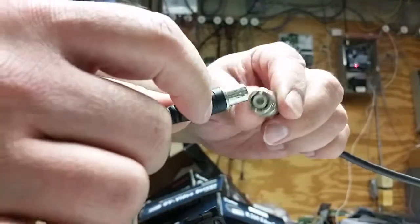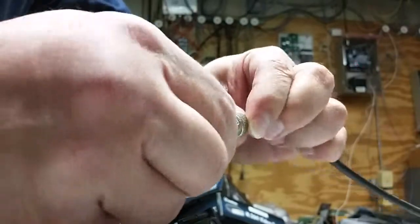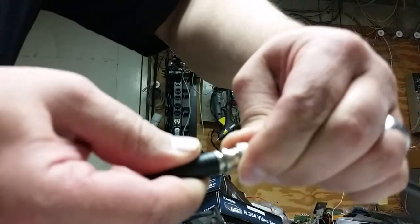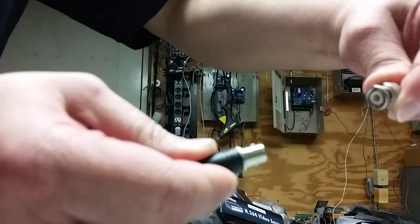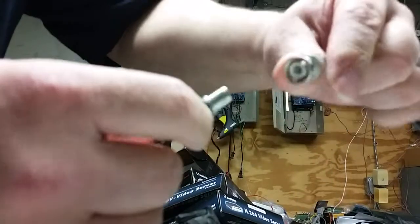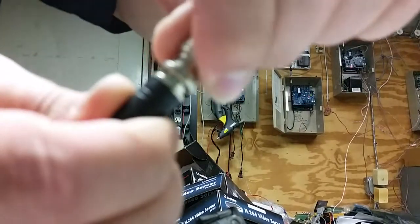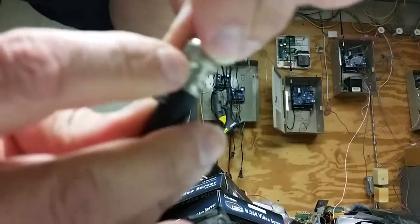Find the camera that the cable belongs to that you need to repair or verify, and you will push in, then rotate — there's a little peg here, you've got to catch that peg out of the gap. Once you've rotated it approximately a quarter turn, remove it and then plug it back in. Always grip it by the connector, never by the wires, because you'll damage the crimp. So push it in and rotate it and it will click. There's a little divot there that it catches.